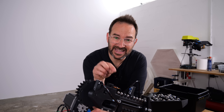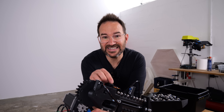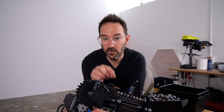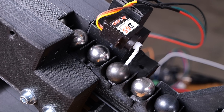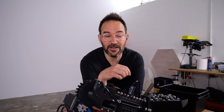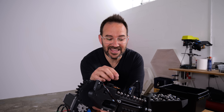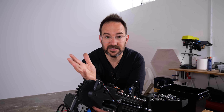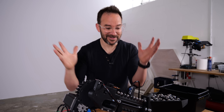We've reached the limit of what can be done with the servo because it cannot get out of the way fast enough and we need to stop every time we reject a marble. So I'm going to try next with our trusty old friend the solenoid, and see if we can do the entire process without stopping the chain — or everything breaks. We'll see. Whatever happens first.